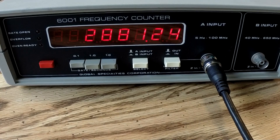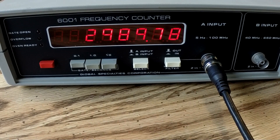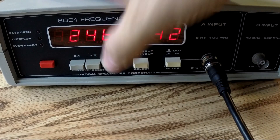Right now I have it set on the dial for three megahertz. Of course that's not perfect, so it's hard to compare exactly, but it looks decently accurate. The dial could very easily be off. That reading is about two and a half on the dial. With a gate time of 0.1 seconds — we go to one second and gain a digit. Let's put it in here actually.